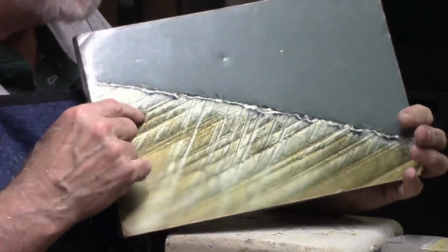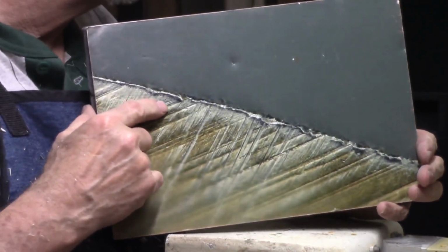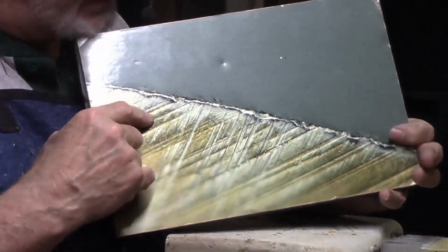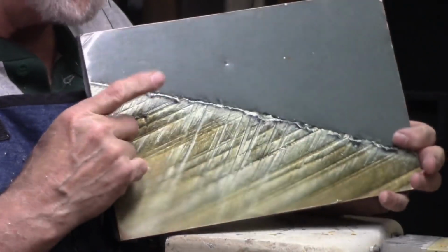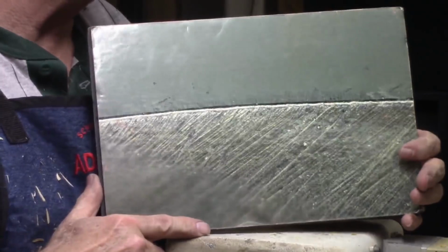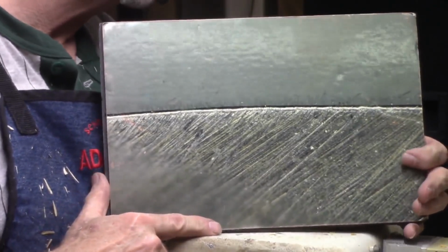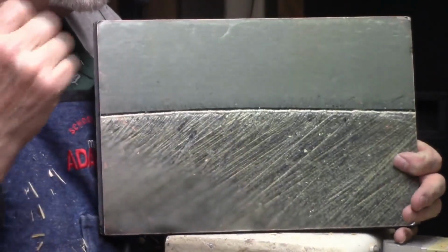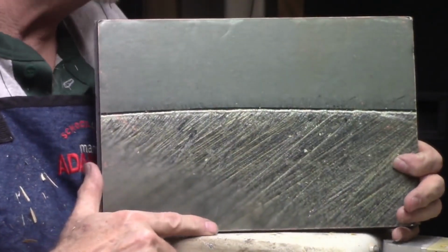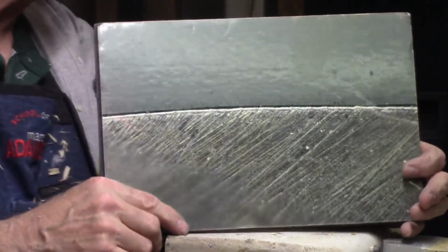He theorized in the 50s that those burrs that are produced on a scraper are melted on. I don't think he's too far off the mark. It looks like an arc welder produced it, doesn't it? I only use this to start with, where I'm going to rough. And it's in all the old books. You find it in books in the 19th century. Frank Payne talks about it. It's a burnish burr, not a burr off the grinder. That's where you start, but we burnish the burrs. And we control the size of the burr and the types of burrs by how much pressure we use. Can't do that with a grinder, turns out. So a burnish burr. And what I use is a piece of carbide as the burnisher.